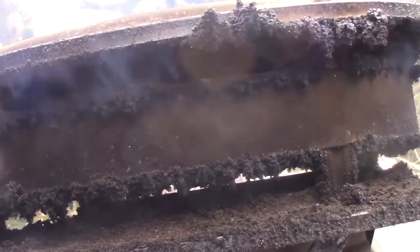Now if you use the coke can method, what will happen is your creosote will turn to a powder, but it'll get caught in the top part of your stove pipe. If you let it build up for a while — I've let it build up here so you can actually see it — the dry creosote has built up to the point where the openings are almost completely covered and blocked by the hardened creosote.